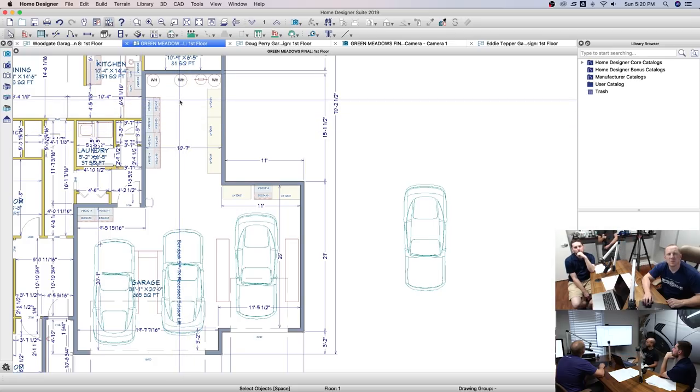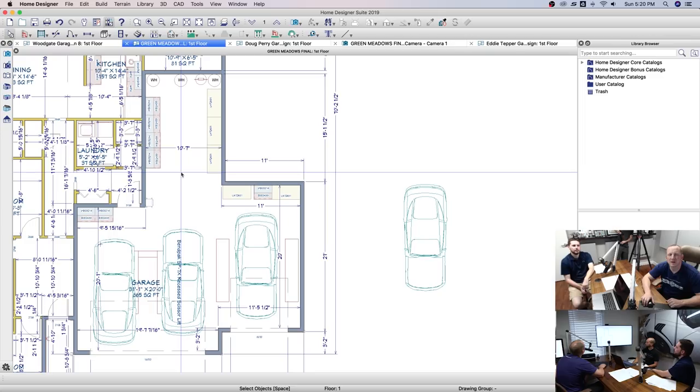For lights, you're going to want one, two, three lights right down the center of this tandem section — just six bulbs right in the middle. In the main area you'd want about six fixtures, positioned just outside the lift area. Run right down the middle and a couple in the other section. Decide whether you're okay with less light directly overhead above the lift.